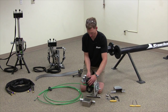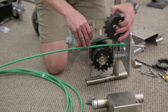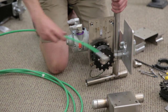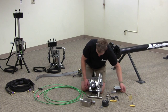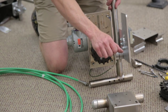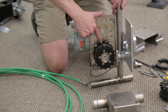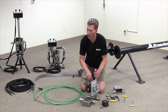To swap gear packs, each gear must be completely removed. The first one is removed by completely removing the three-eighths inch bolt on the back. The second one is removed by loosening the socket head cap screws within the gear pack so that it can release the collar attached to the shaft.